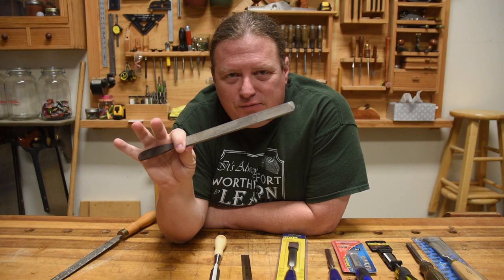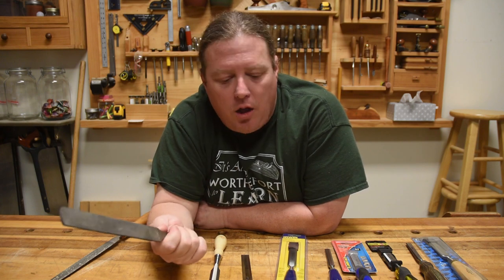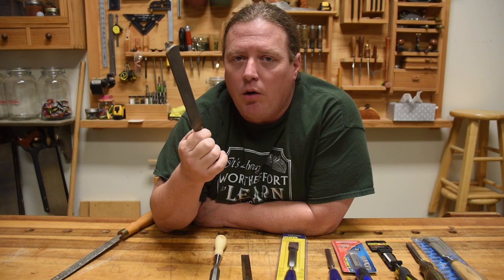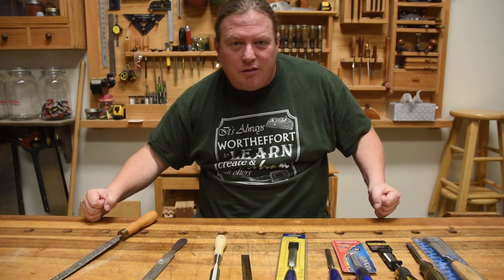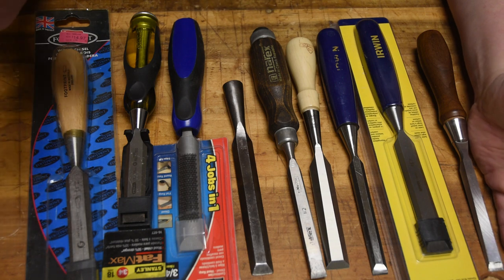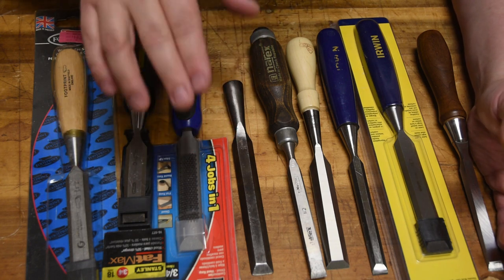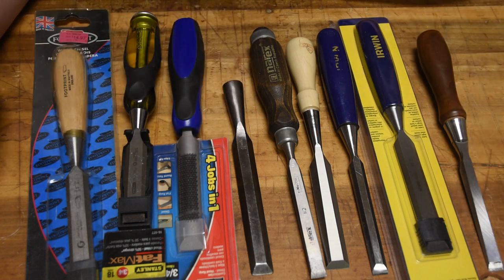This file right here — I cannot bend it. If I were to throw it on the concrete it would more likely snap in half than bend. Whereas if you heat up that same file to maybe 450–500 degrees and let it slowly cool, that's when you could start bending it. That was the old carnival trick where strongmen bent steel — they'd soften it beforehand. In chisels, you can have a variety of not only different steels but different hardnesses depending on how they were manufactured and heat treated.